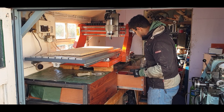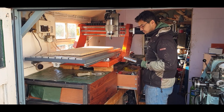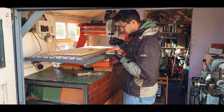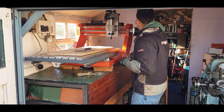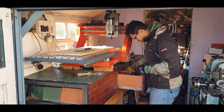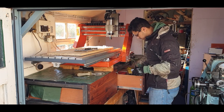My intention here is to use a piece of chipboard and then use some sticky tape on this once it's milled flat to hold the aluminium in place. In hindsight, using chipboard is quite a poor choice — it just gets saturated with the coolant, doesn't stick well to the sticky tape, and causes a world of pain later on. So if you've got chipboard, chuck it away. Use something else.